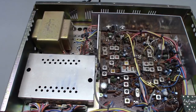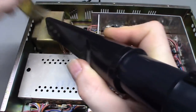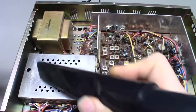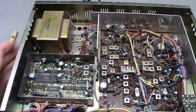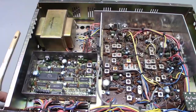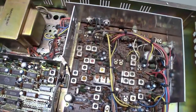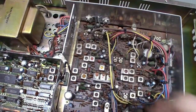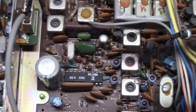Let me vacuum off some of this dust before I get a cloud going. Getting the cover popped off — looks nice and clean in there, nothing obvious, nothing let the magic smoke out. As for the glue situation — this one doesn't look too bad. It's got glue around all the ferrite beads like normal, but the PLL area, which is a common problem in these radios, looks okay.